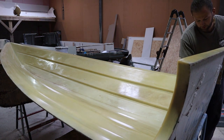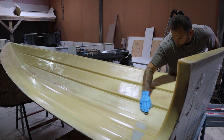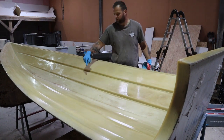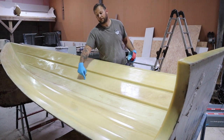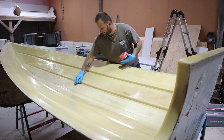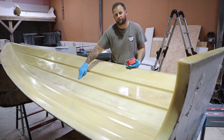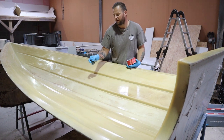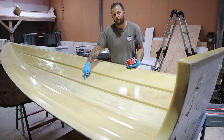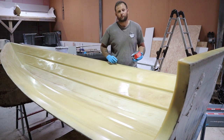Well, I'll show you a bit of polishing off in a minute, but it's pretty much the same as what you're doing now. You put it on, you let this dry, you polish the wax off, repeat, repeat, repeat. And then once that's done, these little holes can be used for pushing airlines in to release the component from the inside. So we'll just use some beeswax putty and clean them off and flush them off as well. When it releases, there'll be a little nipple of beeswax on the bottom of the hull. But if we get that nice and tidy with a razor blade when we trim it, that way it's going to be the smallest blemish possible on the bottom that needs repairing.